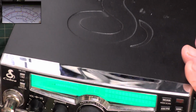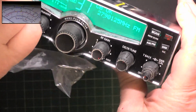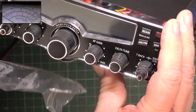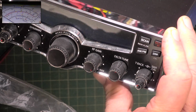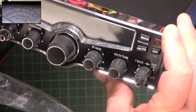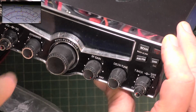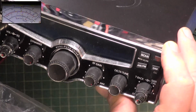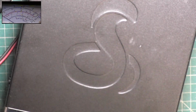and we were using it as a demonstration for somebody else who was concerned that when it switched off, and I'd never noticed this before, when you switch the radio off, and you switch your power supply off, and you switch your power supply back on again, the radio boots up momentarily, even though it's off. That's because its on and off switch is a standby switch. It's not because the radio is faulty. So that's what that was about.